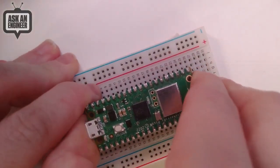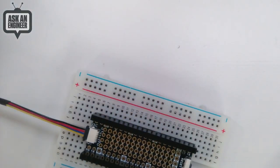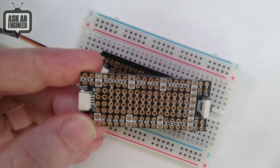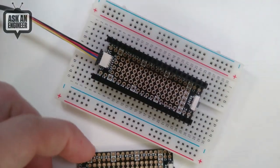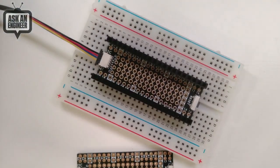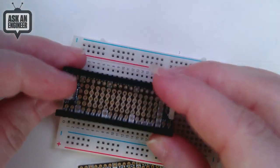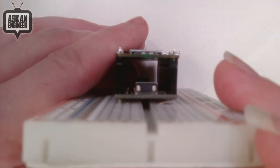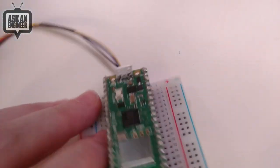Let's go to the overhead to explain how this works. The Pico often already has headers attached. The Proto Cowbell does not come with headers, because you can configure it in so many ways: you can plug in skinny sockets for a super slim profile, stacking headers — which I recommend — or socket headers. Personally I like stacking headers the most because you can plug it into a breadboard and plug the Pico on top.